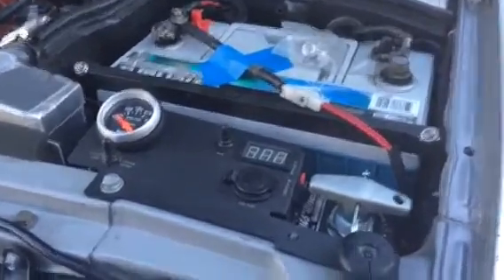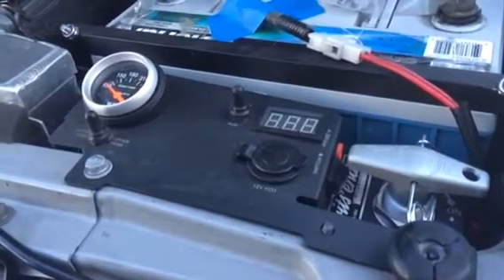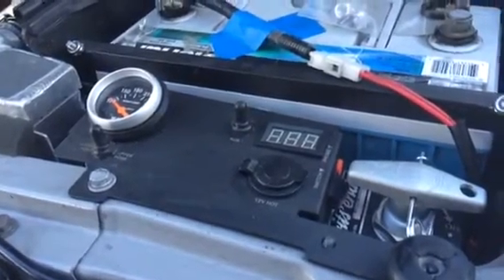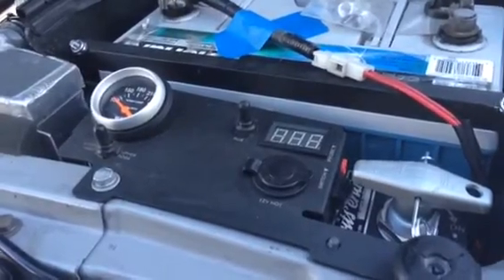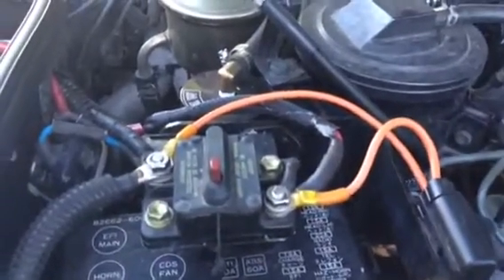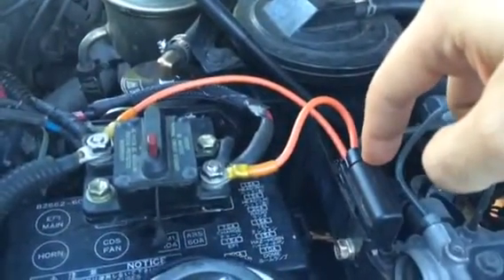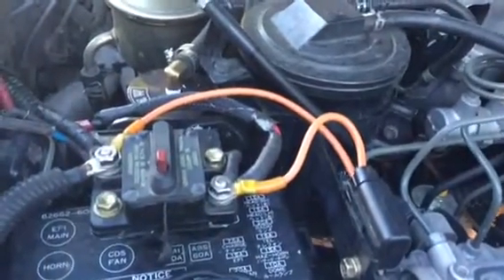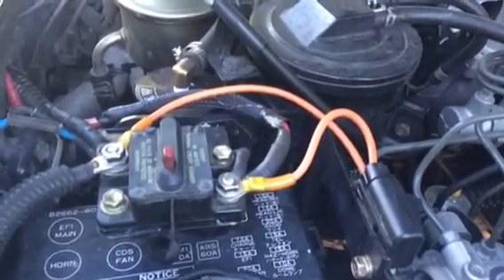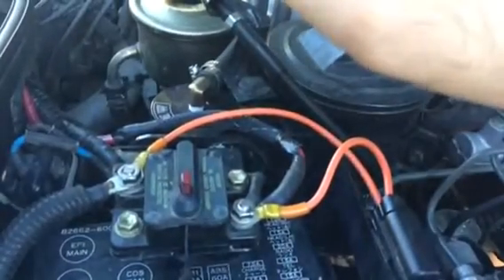This really came up because of my little quick disconnect tool down here. I'm doing a rewire so I have the positive set up with an 80-amp circuit breaker and also a 15-amp bypass. I'm going to test it with the bypass hooked up — this is the positive being removed quote-unquote — basically I'm going to click that button while it's running and see what happens.